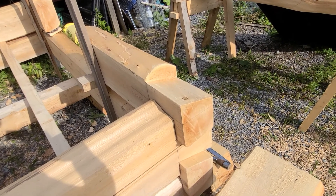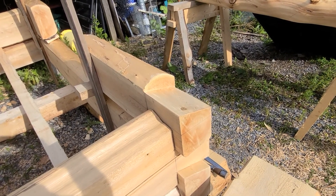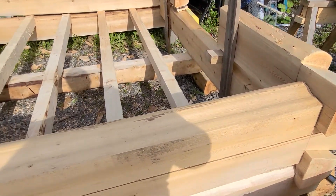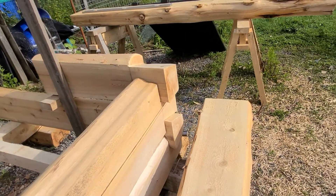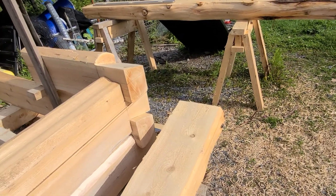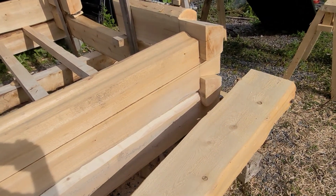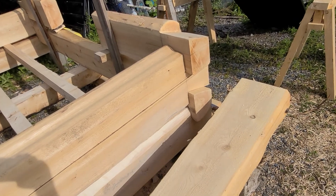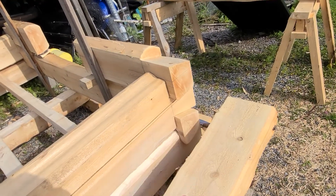I'll put four posts — still not sure how high I'm going to make them. I do want the roof line pretty high up and it's going to be a 12 by 12 pitch. That's kind of the plan. I've never done this kind of joint work before and I'm actually pleased with the way it's turning out. All of these gaps in here — what you do is tack in a wire lath and then grout that joint.